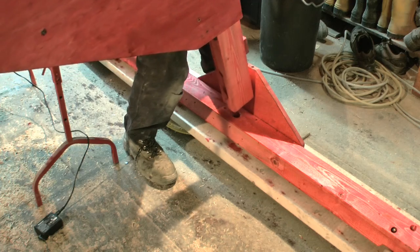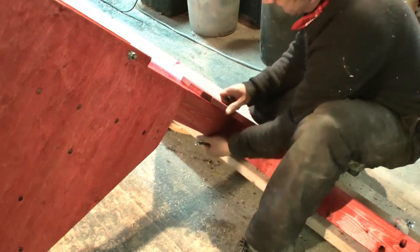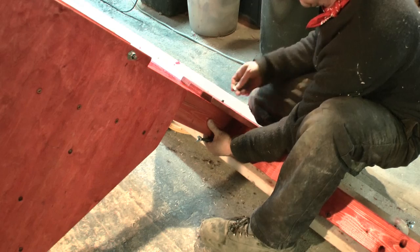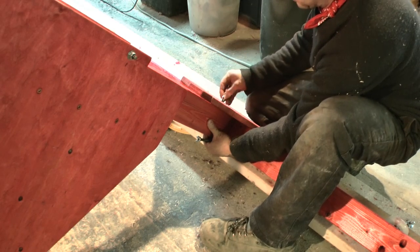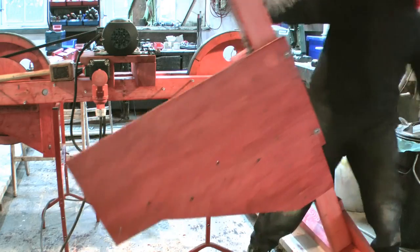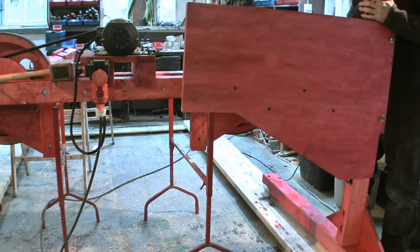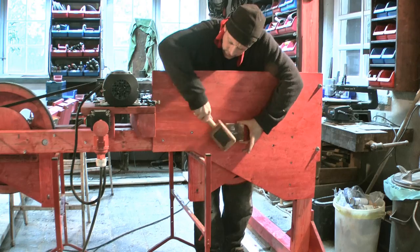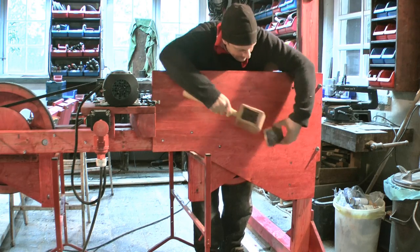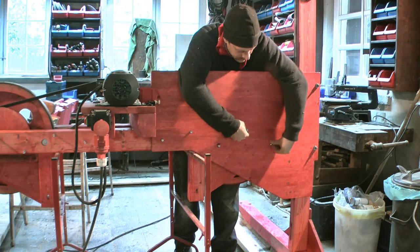One post is mounted on a horizontal beam with four wheels that ride sideways on a diagonally cut profile. The other post has only one pair of wheels on its bottom. The two posts with their wings are attached to the mainframe. I used many threaded screws with wing nuts to give it maximum stability and to be able to take it apart easily.